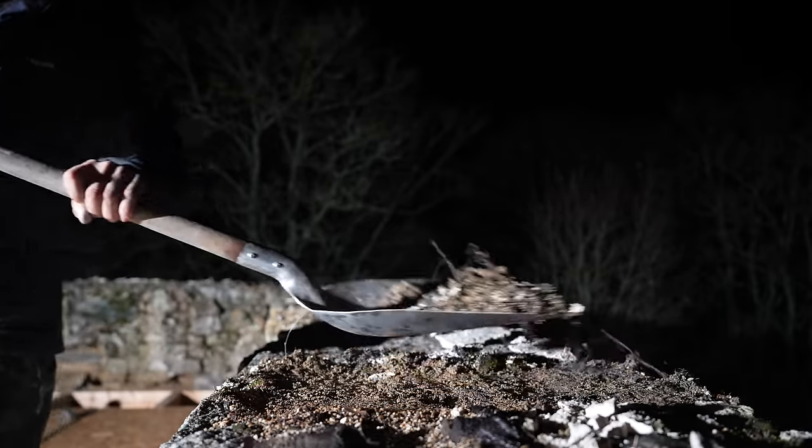Okay. So, that would be pretty easy actually. So this steel is going to sit here. What I'm going to do tomorrow night is smear a load of plaster while I can see, get a good level. Smear it all pretty much level, fill all these little bumps in, and then once that's dry, I'll put a skim coat of plaster on, and I'll just pop this beam on top, and that should make the whole perimeter level. It'll make more sense when I do it, as all these things do.